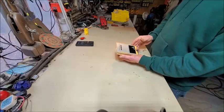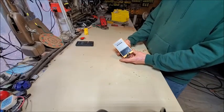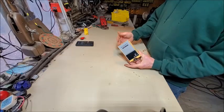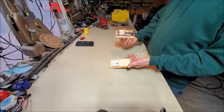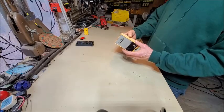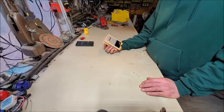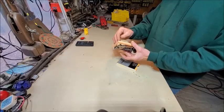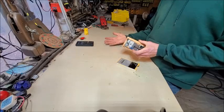So this is what I'm going to use to automate it. This is a really old-school thermostat. This powered up a baseboard heater in my home — the baseboard heater was 220-volt, which means it needed two hot legs and a ground. It was a two-wire circuit. What makes this so neat is it's all mechanical — this thermostat is not powered by a 24-volt AC step-down transformer.